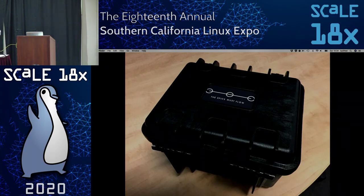You can kind of see that the Pi 4, because of USB-C and not much else, is twice as big. Obviously, it's more powerful, but not because of what you would expect. Really, what we want out of the Pi 4 is the switch, as it will be obvious towards the end of the talk. Pi 4s have actual gigabit Ethernet as opposed to the 100 megabit Ethernet of the older Raspberry Pi.